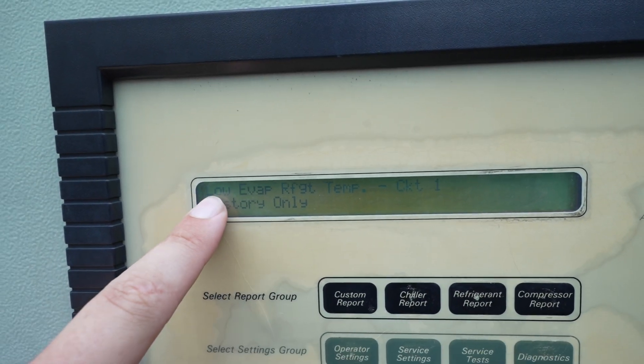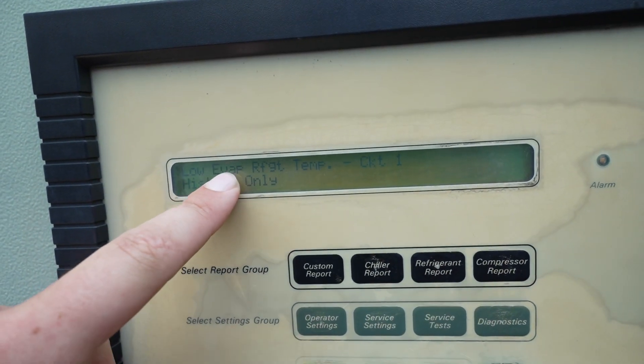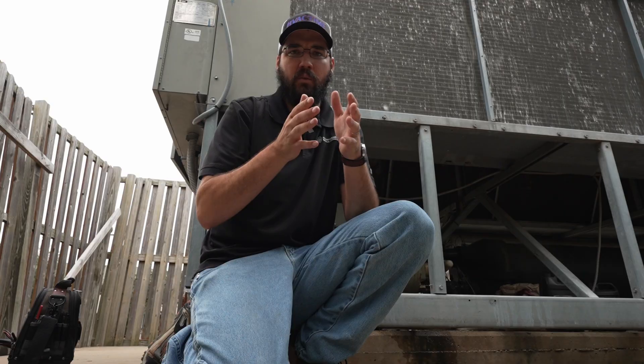Let's walk through that. Let me show you how we improved by adding the oil — that got part of our problem fixed — but the actual main issue that led to that call to begin with. You can see here that the original alarms triggering from the beginning have been low evap refrigerant temp. Every morning at startup, this machine would try to turn on and it was tripping on that alarm fairly consistently, and we've been trying to work through why.